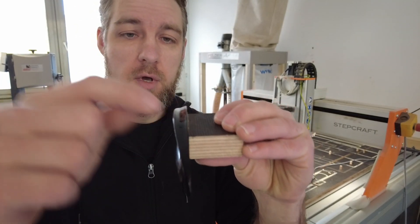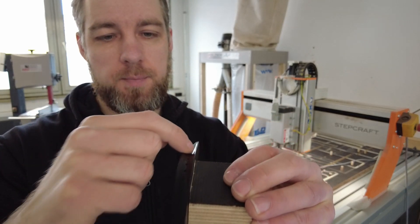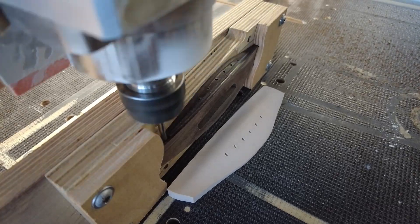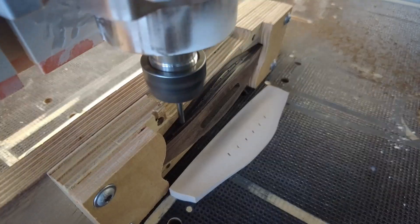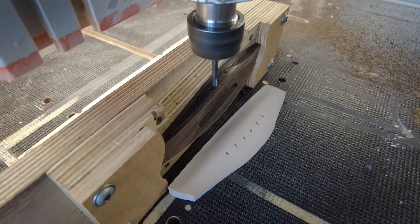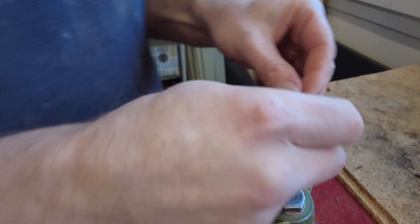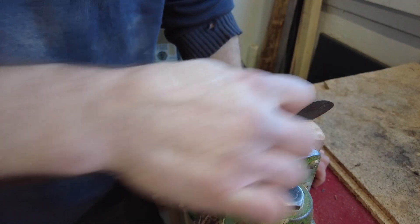The last step on the CNC is to make this little groove so that the ball ends don't stick out as much — they sit nice and clean in the groove. I use a round end mill to route out the rough shape and get rid of most of the material. It's really hard to make it super clean so I leave a little bit of material and do the rest by hand, finishing the concave shape on the back which is quite complex and needs a little more work.